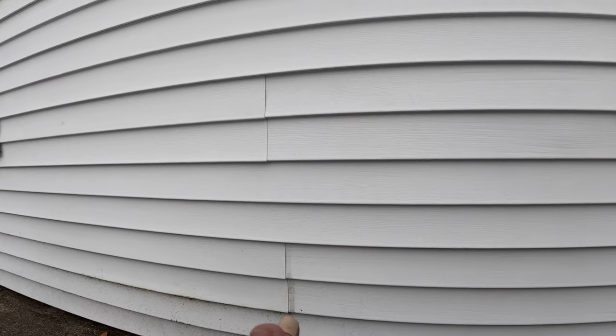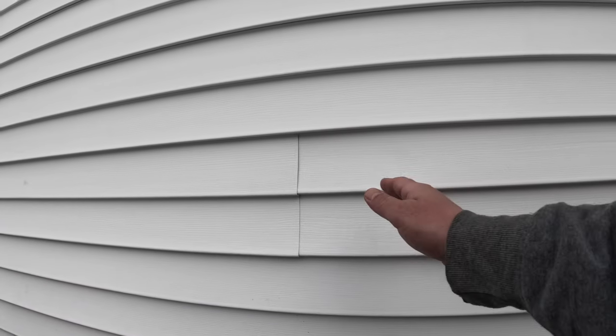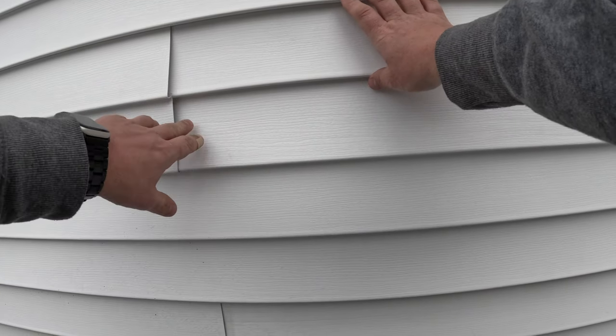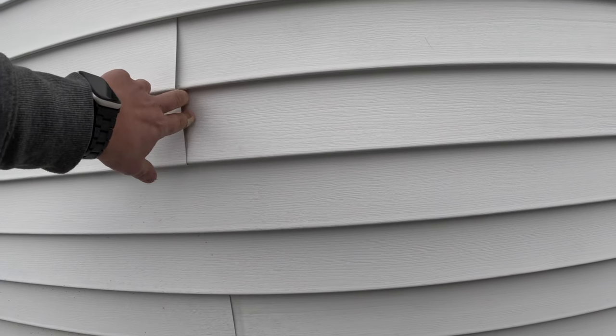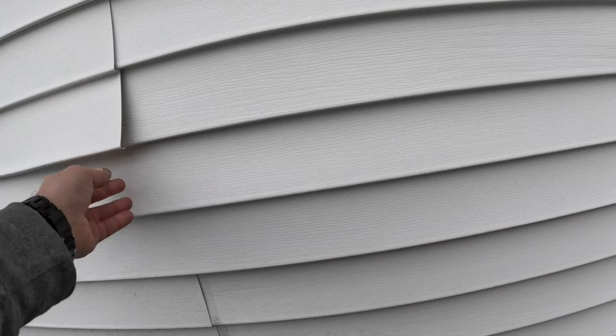We're going to look at identifying the siding that you have. What we want to do first is look and see just how faded your siding is. The way you can do this is either look behind a shutter, or look on a section of your wall that's in the shade most of the day, or pull apart this seam. You can see how I snuck my fingers in there, then pull down and out. You want to do this when it's warmer out — if it's cold out, it's probably not a good idea because you'll crack right here and you'll be replacing even more siding.